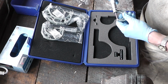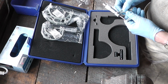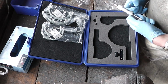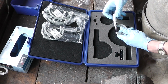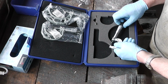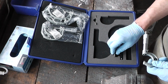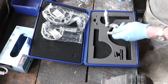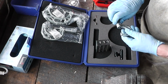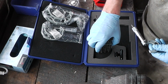Do this up to 0. And it's not right, is it? You use the correct end of the wrench. Right, let's test it with that 1 inch bar they so thoughtfully provided for us, shall we? Okay, that's reading a little bit under 1, 2, 3 block. These are called 1, 2, 3 blocks because they're supposed to be 1 inch by 2 inch by 3 inch.